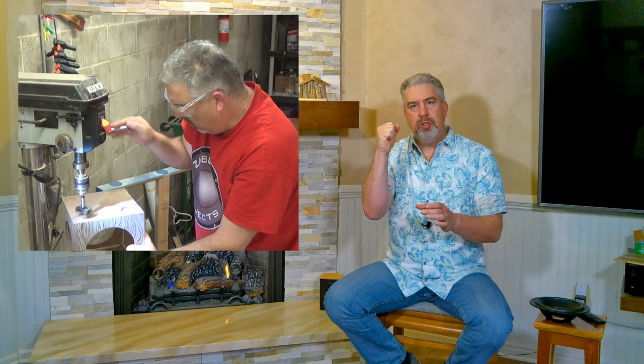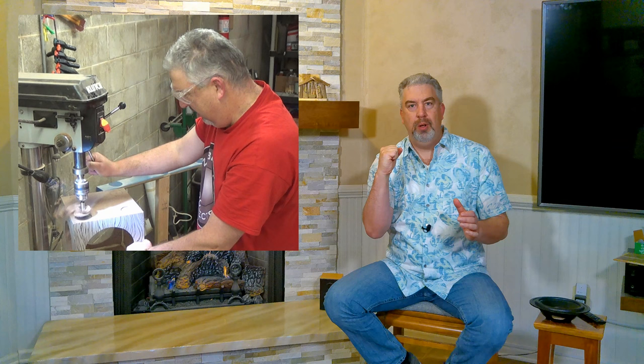But what happens is when you press something like that down, the outer edges tend to be more dense than the inner layer. So for example, with 3/4 inch MDF, when you drill it, say with a 1/4 inch bit, you'd never notice this. But if you use, say, a Forstner bit, say 2 inches or more, when you drill it in a drill press, you're going to notice that as you drill through the first layer of that MDF, it's very dense and hard to push through. It takes some effort. As you get into more of the middle areas, it's a lot easier to go through, because the middle of an MDF panel is less dense than the surfaces and the faces. So that's true with thicker MDF and thinner MDF. It's more dense at the face of the board than it is in the middle.